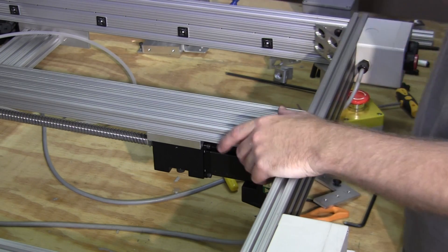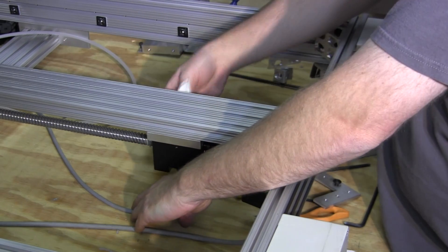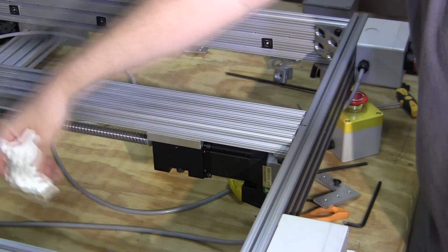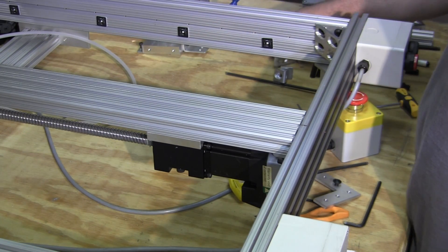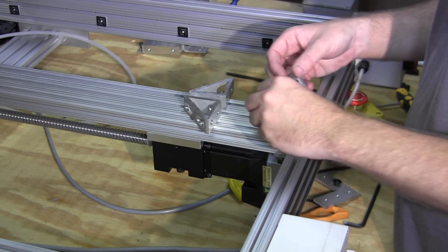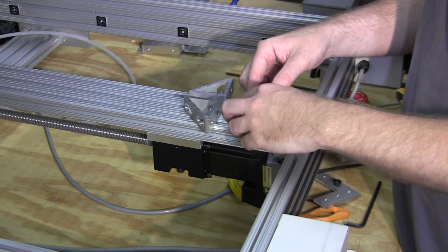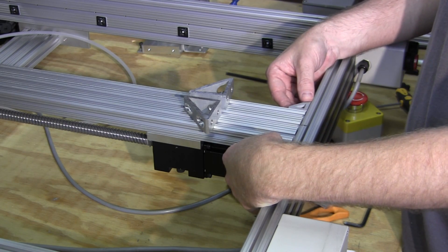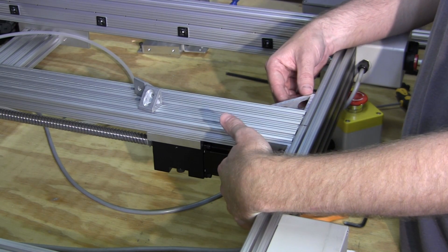So how do we fix this? Well, in the back the back should be fine - I can get to those screws, it's not an issue. I have two options: I can use those 45 brackets or I can use these 45 brackets. The shelf that this is sitting on is really taking the downward load. All I need to do is maintain its position. I can easily come in and do the brackets like this, or if I really want to beef it up I can do the brackets like that. And that is how we're going to fix that.